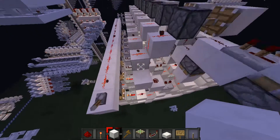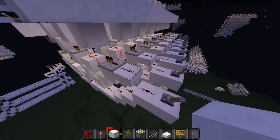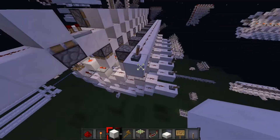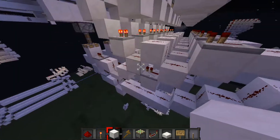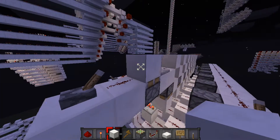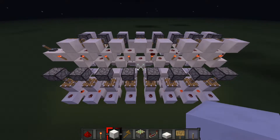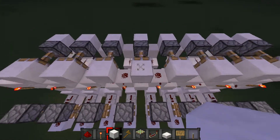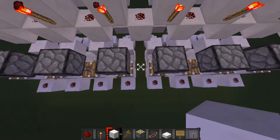That's just about everything for the demo. Let's talk about the way this thing works, because it actually uses a really cool strategy to make this design really, really small. It implements the fact that the value is going to be saved back into a register, and we're not just taking one value in and incrementing it. In order to understand the concept behind which this incrementer slash program counter is built, we actually have our own incrementer right here, which we're going to be using to prove the exact concept that this is based off of.